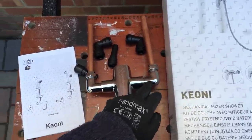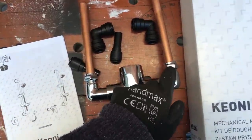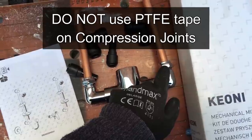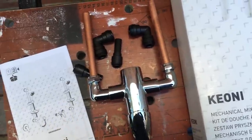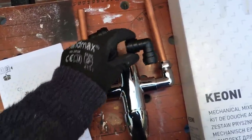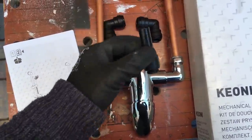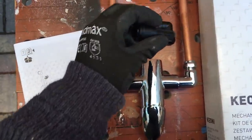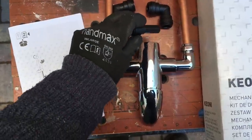It's got a hot and cold supply, and these have got 15mm compression tails on here. So I've just taken a short piece of copper and made that joint with a bit of jointing paste — no PTFE tape because this is a compression fitting; the joint's made between the olive and the fitting. Once I get through the wall of the shower with this copper, I'll put these John Guest push fit elbows on the other side and then convert from 15mm down to 12mm with these adapters, which will connect onto our LDPE John Guest tube.